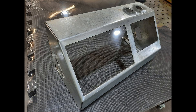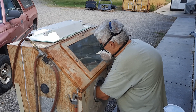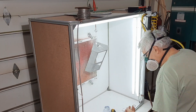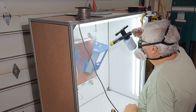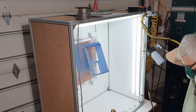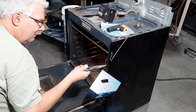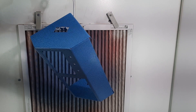Here's the enclosure before I cleaned it up, and I'm going to go ahead and sandblast it. I'm using aluminum oxide and I'm going to powder coat it with Prismatic Powders Baja Blue. I'm going to put it in my converted oven — it takes 10 minutes at 400 degrees — and here is the final enclosure.